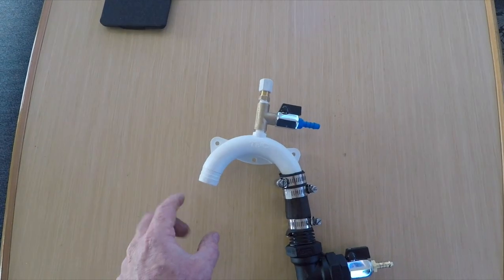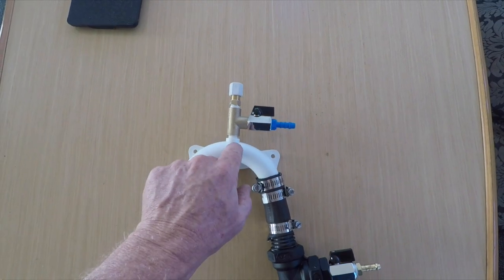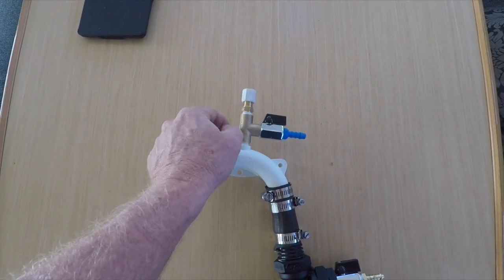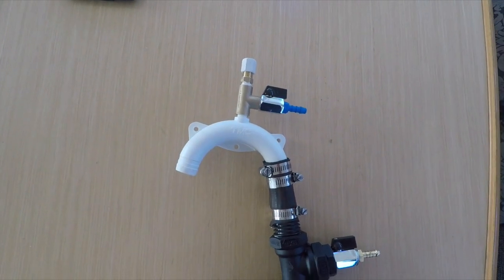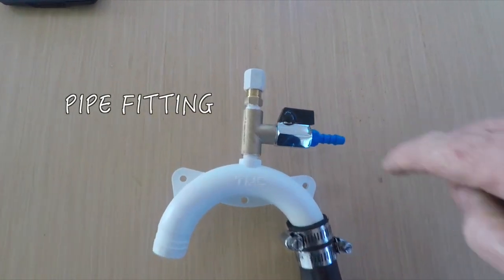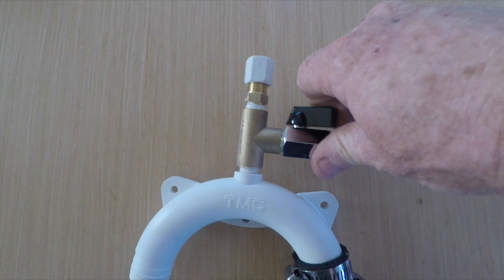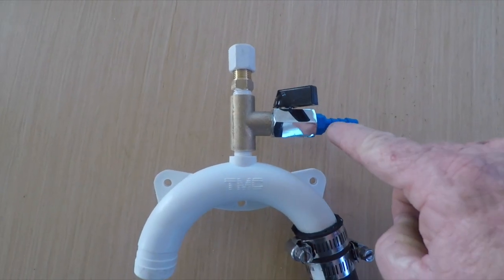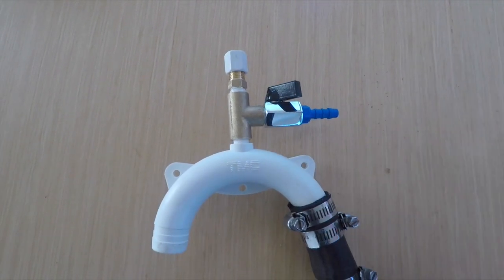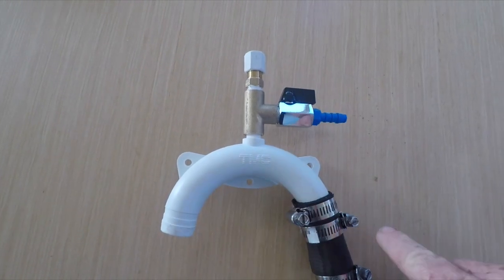When we get an airlock, it's very difficult. One needs to bleed the valve by opening this little one on the top, which normally sits on here. Opening it up, bleeding air through it, getting the water to flow over the top, closing it off again. I don't like that because salt water ends up inside the boat. So what we have done is I've put a T junction into here, put the venturi on the suction valve on top, and then we have a little tap in here, which I fitted, and I'm going to put a pipe on there. So instead of undoing this and getting salt water into the boat, with a tube going out here, I can lead the salt water away from the boat and do the bleeding, get the water flowing that way.